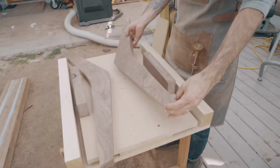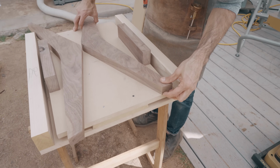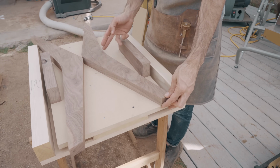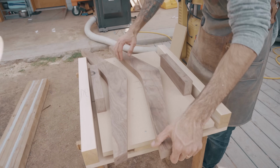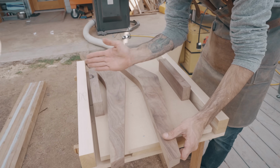So now I need to line this up with the bottom of something like that, and then I need to measure up. This has to be perfect, and then I need to measure up and get a line right across where I need my seat to be, right? Yeah. And when I know where my seat needs to be, I have to line up my seat line with the line that my table saw is going to be cutting.